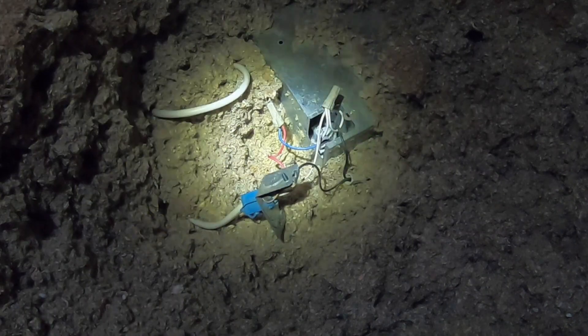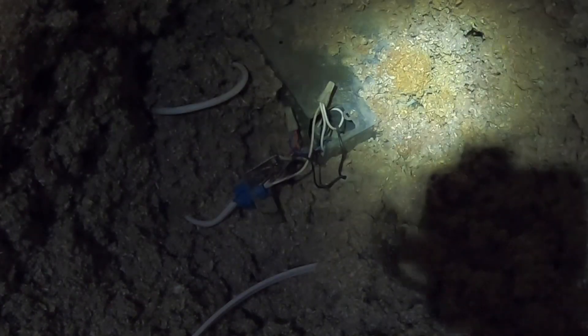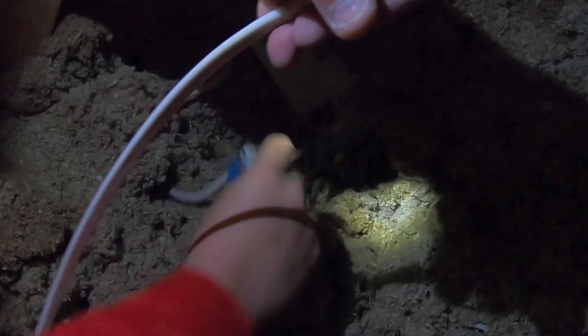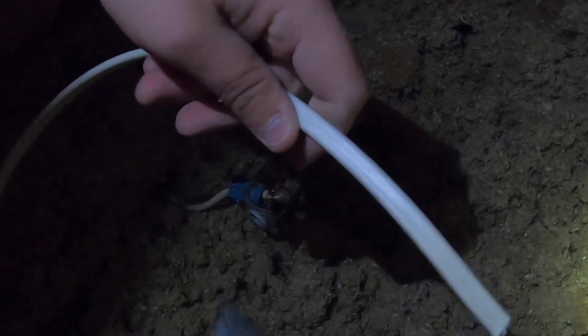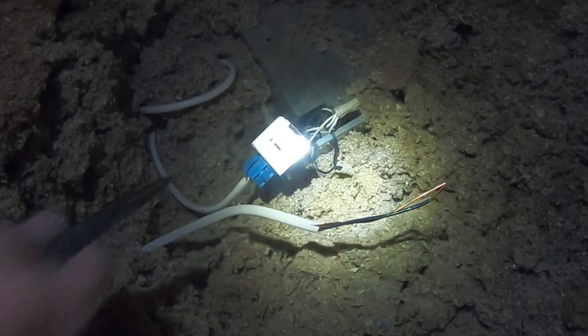Pull this out to get access to the wires - that's exactly what we want. Put that screw in a safe place. I'm just spreading out the wires so you can see the different ones. I went ahead and grabbed some wire and took it back to the hole, giving myself about an extra six or eight inches more than I thought I'd need. We're going to go ahead and measure and cut about an extra six or eight inches. In the center is the ground wire - if you cut it nice and close in the center it will help strip and peel this back, since that ground wire does not have any insulation on it.